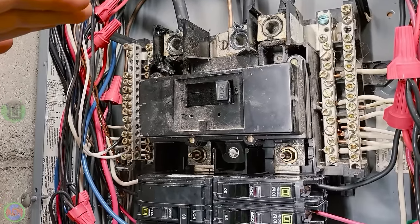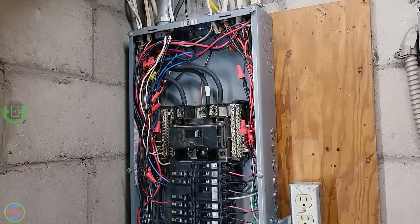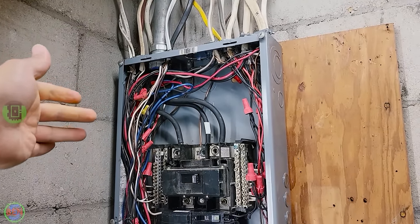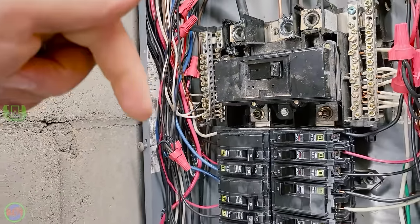You can buy replacement main breakers if you have to buy a 200 amp panel like we did and you are future proofing like we did, but you have it being fed from a meter directly and you're leaving the original service entrance cables. You can buy a smaller main breaker to pop in here. They make 100 amp breakers that'll fit right in this space. So I'll make sure to link those in the description.